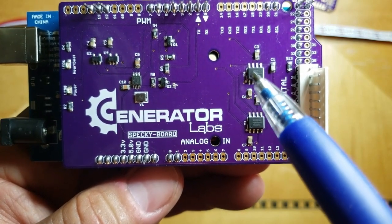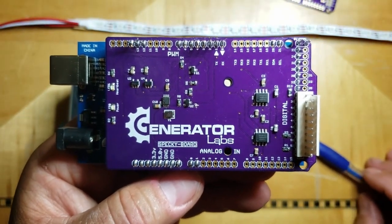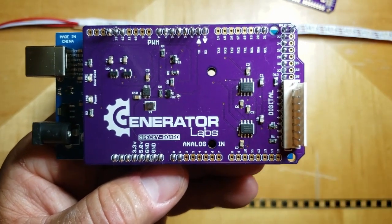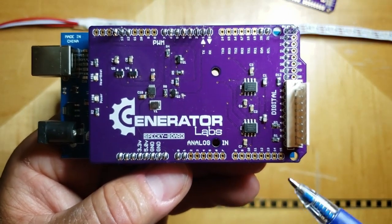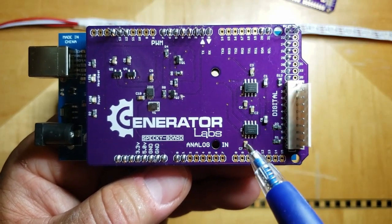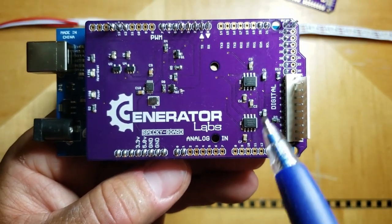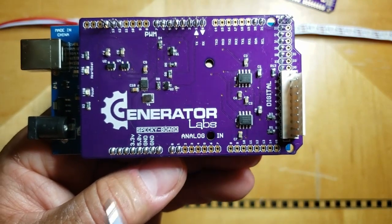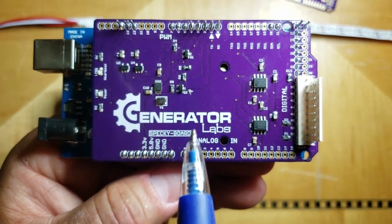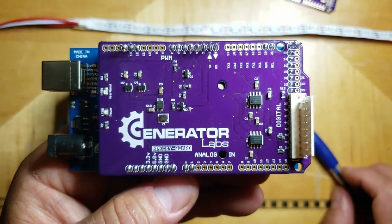And you can even get these frequency slicers in different formats. But the reality is that a properly designed board with surface mount components is going to perform better than an equivalent board that has through-hole components, because of the way the ground planes are laid out, and there's going to be less susceptibility to noise when you're using small surface mount components like this. If you take a good look at this board, you're going to see that they're surrounded by nice ground planes, and the possibilities of crosstalk between some of these very high frequency lines is minimized because of the way the traces are laid out.